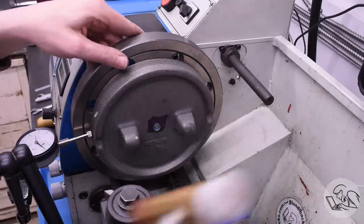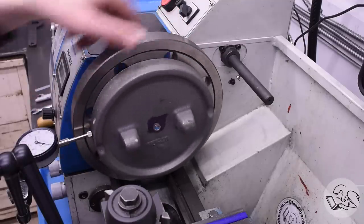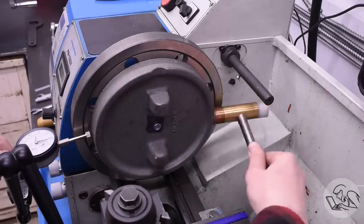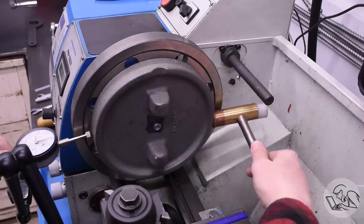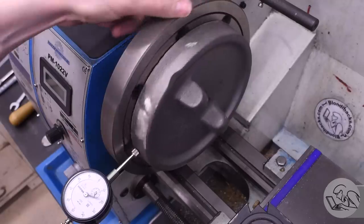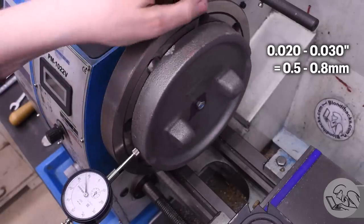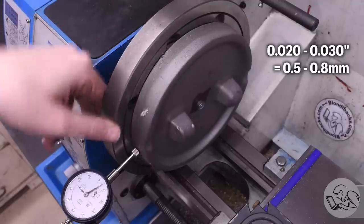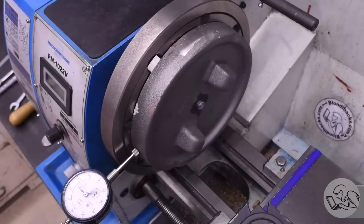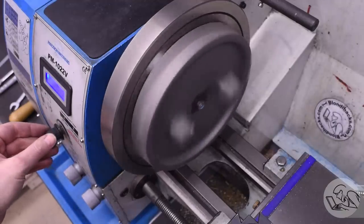With a really out-of-round part, this is the best you can do. Since we're machining all this down, it's fine — we're just trying to average the amount of material being removed all the way around so that the bosses and other cast features end up more or less centered in the final part. Overall concentricity is within 20 or 30 thousandths, which is how it is with castings sometimes. This one's a little more out of round than some, but casting is a low-precision process.